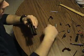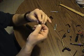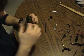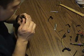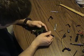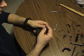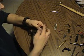Next, put the sear back in, then put the sear assembly together and slide that in there. Put the hammer in place — that's a whole lot less of a hassle. These pins just kind of slide in, and the only thing that holds them in place is the actual thumb safety.